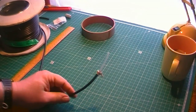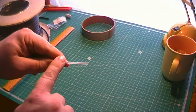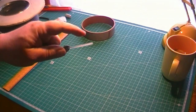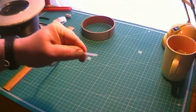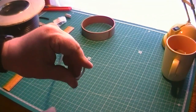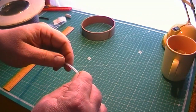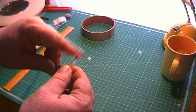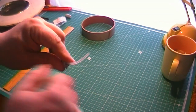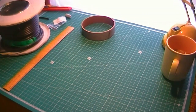type of activation, because it's got a foam dielectric. This is not PE, it's like a foamy type white stuff. Don't know what the actual material is. I find it's not very good crush resistance, and also it's not very good in cold environments. When it's really cold, or even just when you sort of work hard on it, that foam tends to break down a lot more quickly than this PE, so I don't use it.